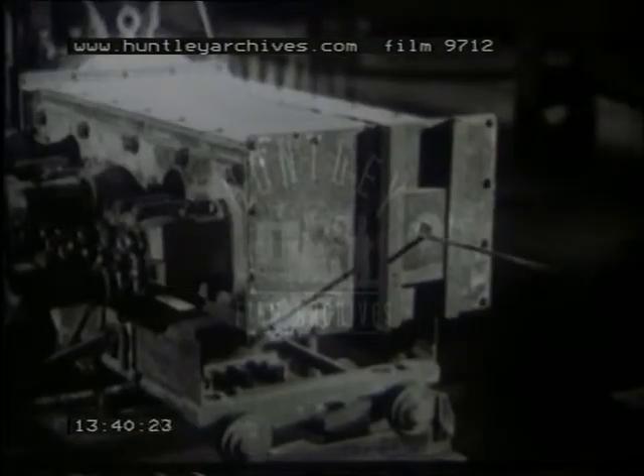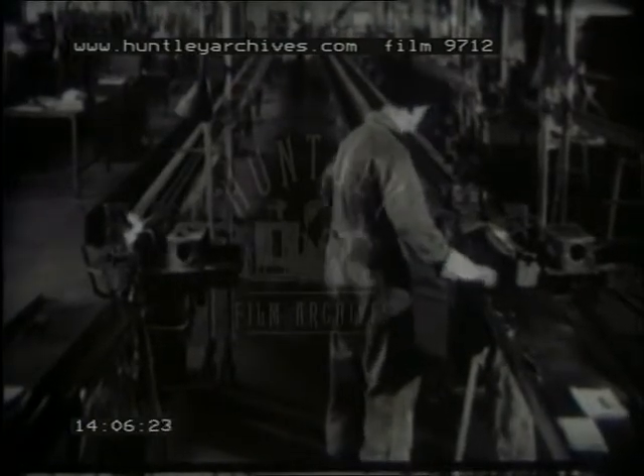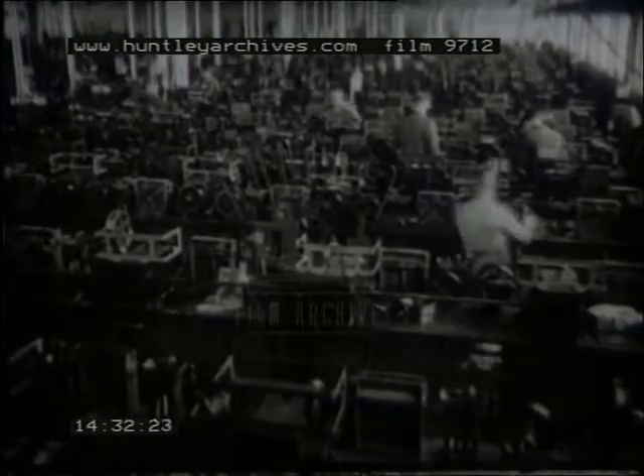In these machines, metal is heated and beaten with hammers in rapid succession, making it thinner, longer and rounder. It is now ready to be drawn to still smaller diameters. Lubricated with graphite, the wire is heated and pulled through tungsten carbide dies by a chain-driven mechanism. This sequence of lubrication, heating and drawing is repeated with smaller and smaller dies, until the diameter of the wire has been reduced to about one-fiftieth of an inch.